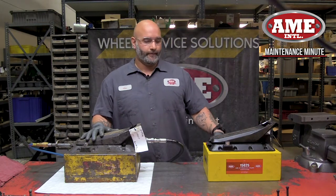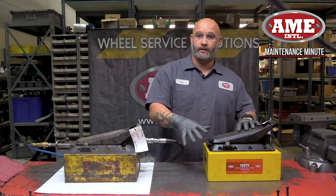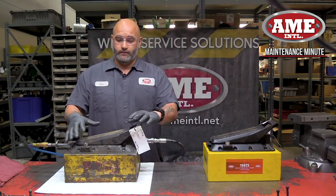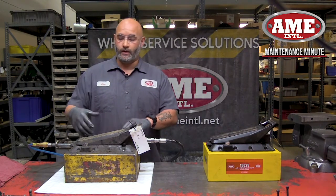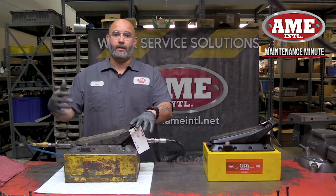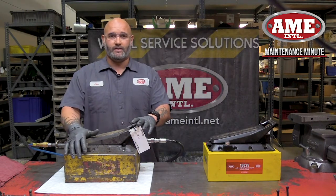A typical thing we see with pumps — this is a somewhat brand new pump, nice and clean. This is what we get in from the field. As you can see, there's all kinds of dirt and debris. The problem with the hydraulic pump is that dirt and debris gets into the air motor. A common call we get is, 'Hey, my pump is just bypassing air.' We get that sound — kind of sounds similar to this.